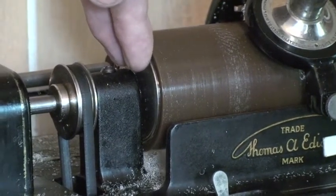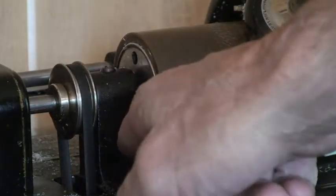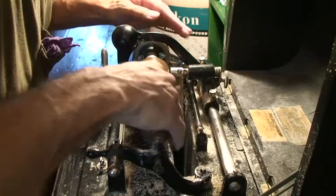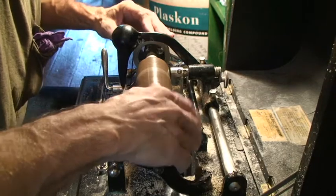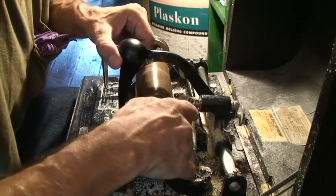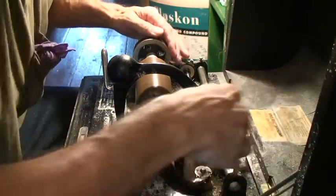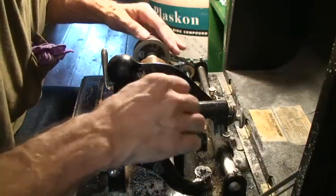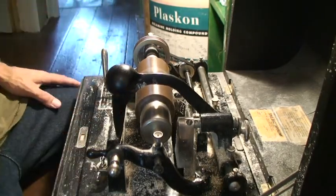That is safe because when it's about ninety-five degrees, it'll be hanging off the end a little further, and you don't want the cylinder crashing into the bearing block if you can help it. So right now we're looking for the high spot. Check the middle and the other end - the right end is higher than the left end, so you have to be real careful. Now that we've identified all those places, fire it up and take a pass.